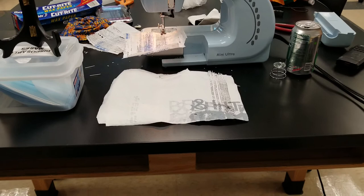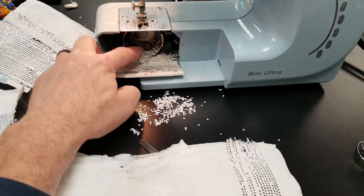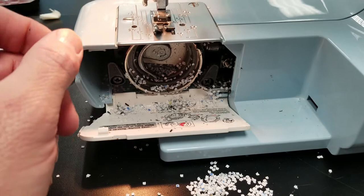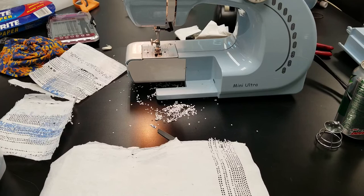These plastic pellets end up piling out of the bottom of the machine. Just use a little brush to clear them out — stay on top of this because if they get wedged in between a wheel or roller, they can start melting in there. I brush and blow it out every hour or so. You can recycle those pellets if you do the tile project; otherwise just burn them up.